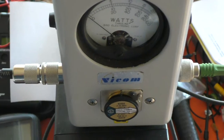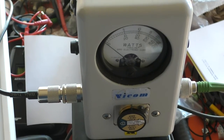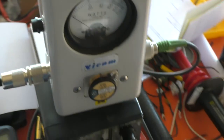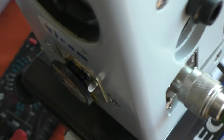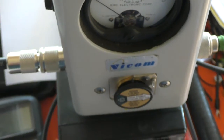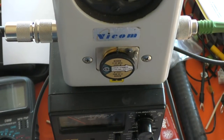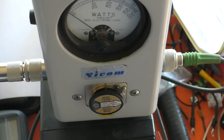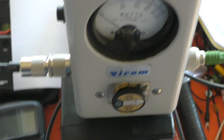It's in and out of a box all day, in and out of a car all day, taken up onto hills and radio sites — these meters do take a fair beating. That's why they're built as they are — built to take a beating, the Bird 43. You can put different slugs in there if you want; there's a little locking device on there that just holds them in position. I don't tend to bother with that because this one I've just taken out of a Pelican case that's got probably three or four different slugs in it, so whenever I carry this thing around it's in the little Pelican box with everything in it.